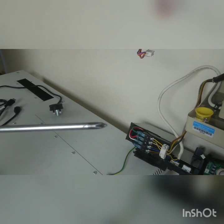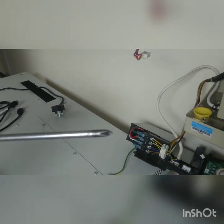The motor is now out. You might just be able to see in there the hole where the screw sits - the screw is still in. So when we put the fan motor back in we don't have to mess about trying to relocate that screw in the hole. Just a point to note: make sure you use a Phillips - not a Posi drive - so you don't wreck the end of the screw. You don't get many attempts to undo it; it is a bit fiddly but with wiggling around it does eventually come free.